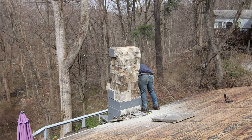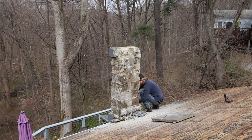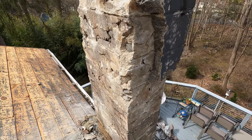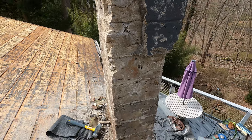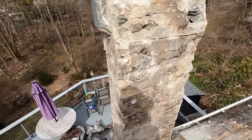I'm having the hardest time right here because I thought it was going to be hollow concrete block, but it turns out it's very much not hollow. Back in the day they poured concrete with rocks into the center, so it's solid all the way through. That's a problem. I called Sal and he's bringing me a gas saw so we can cut it into pieces.